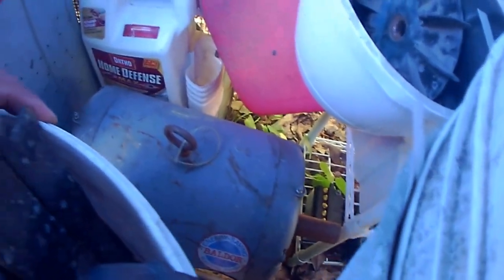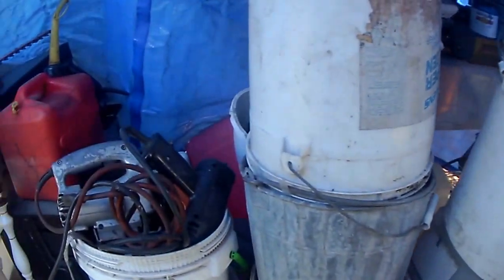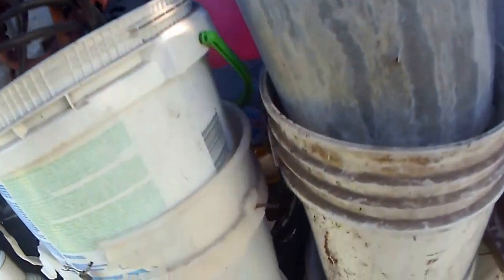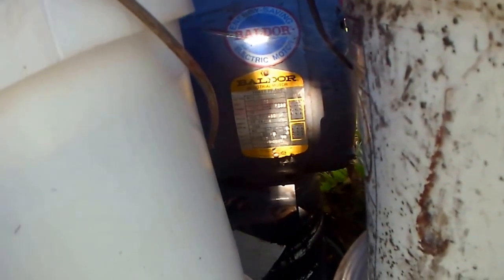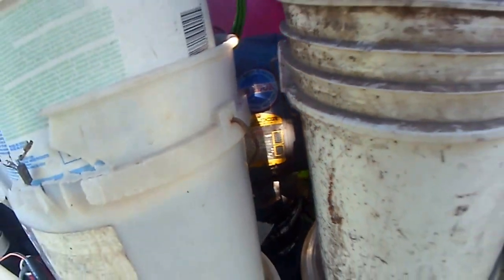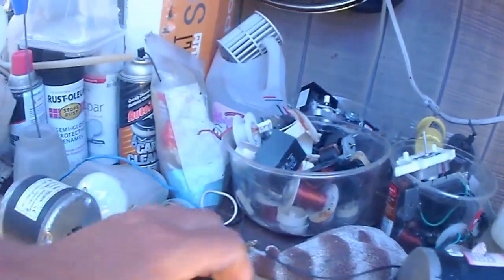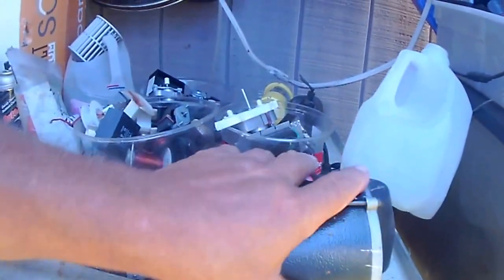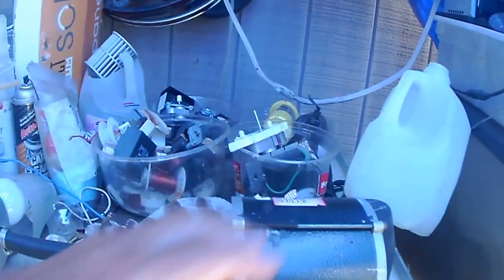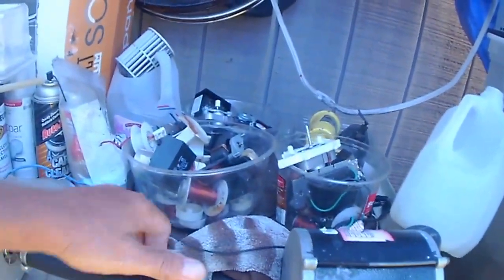Let me see the size of the shaft of that. That's a three-phase, 10 amp — I forget how many horsepower, but it's all on there. Three-phase, 10 amps. This is a one amp, one and a half amp, driven by a DC scooter motor. And this has got three magnets in there and a six wind, so it's three to six. It's low RPM and it kicks out pretty good.